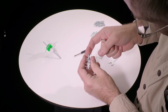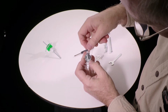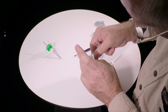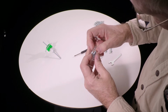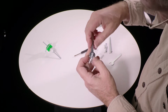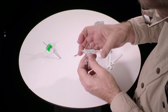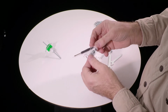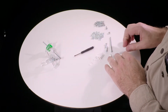which we'll do using a wrench. You can just tighten it. The screw may try to turn a little bit, and that's okay. What we're trying to not do is we don't want to apply pressure to the bottom of the plastic there and potentially crack it. So get it until it's sort of mostly tight. Then you can tighten it. Don't over tighten, but just get it tightened in there. And this should move freely like that. If it doesn't move freely, probably something is out of whack. Maybe these pieces are not square with each other. Something like that. Okay, so that is the shifting armature thing.